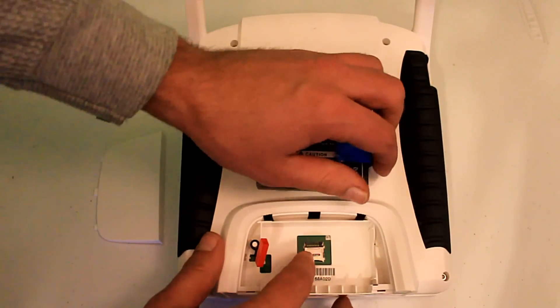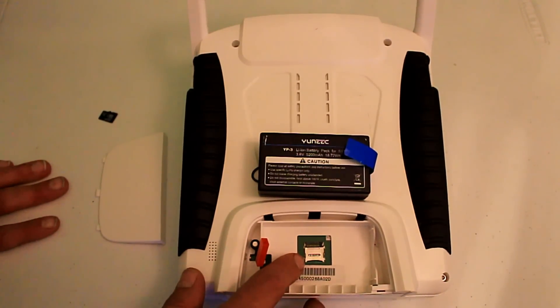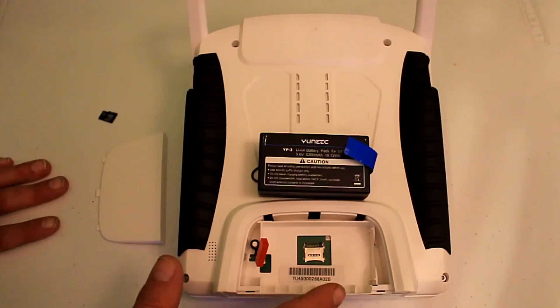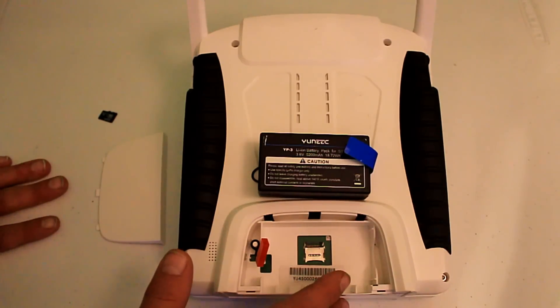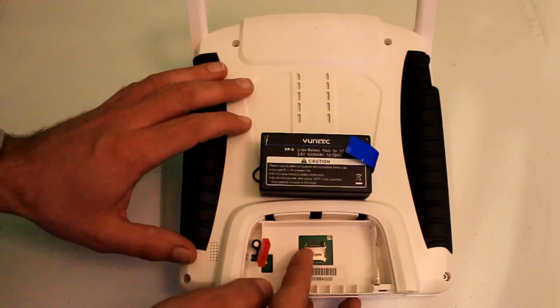This slot right here is where your SD card is. Be aware that these are sensitive electronics — in the wintertime, static electricity is a big deal. I've fried a couple of components in the past, so if you have an ESD bracelet you could wear that, or if you're barefoot your ground potential will be minimized as well.